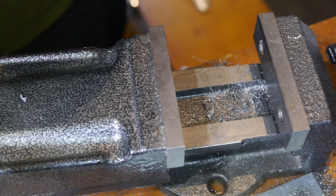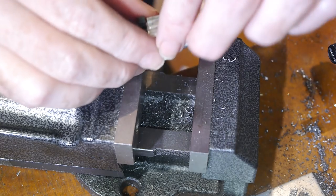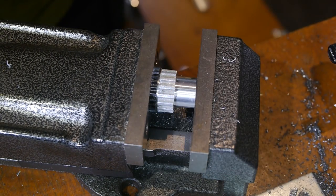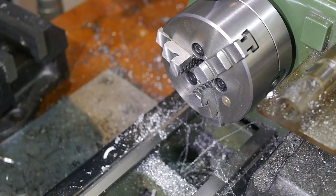The vise was tightened just enough to ensure the two parts were parallel while the retaining compound cured, and I avoided over-tightening, which might cause the aluminium to deform. The bond was left to cure overnight.